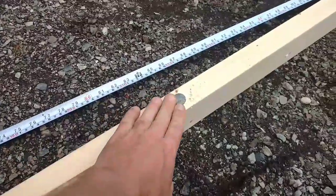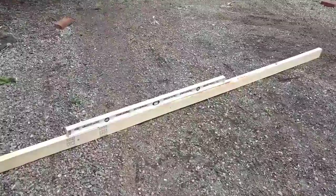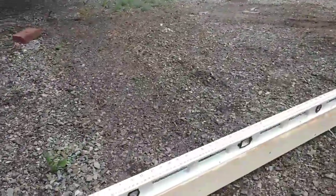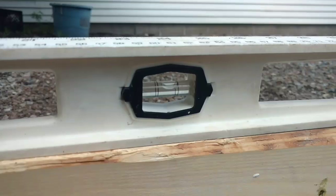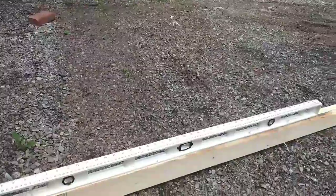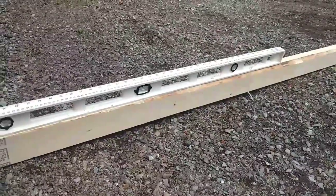What that's going to do is secure this end of the 2x4. The idea is quite simple: you're going to rotate the outer end of the 2x4, and when you're rotating it, you want to look at your level in the center and keep the level bubble right in the center. When you're spinning the 2x4 around, you want to either remove some material or add some material, constantly moving it a couple of inches at a time, leveling the ground as you go.